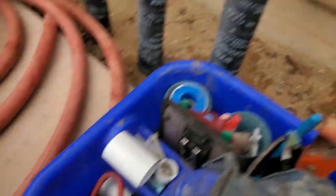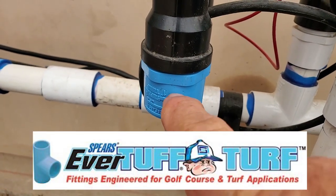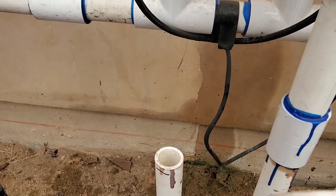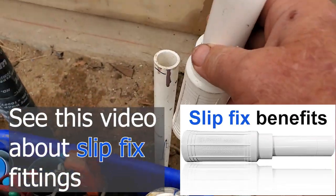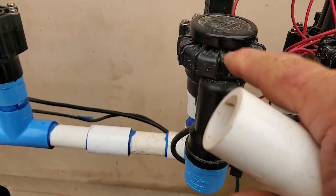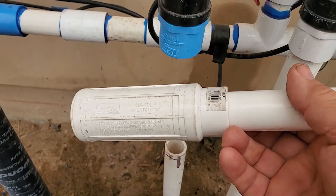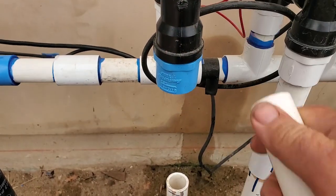I removed that assembly and I'm using an EverTough male adapter on here. If these things are going to get pinholes in them I don't want the new male adapter to get one up here too, which they can do. I'm not real crazy about using this here, but under the circumstances it's going to be difficult to take this valve off with this close proximity. I'm just going to extend this as far as I can so that it doesn't have a lot of play in it once the water turns on.